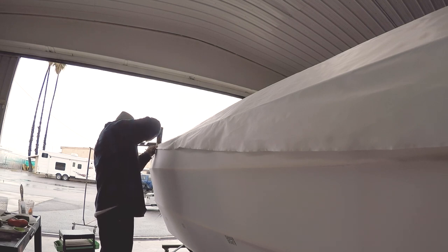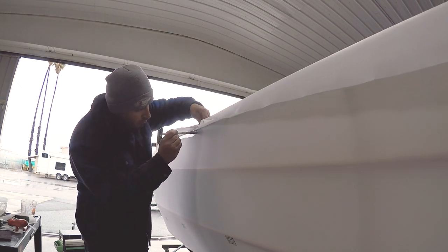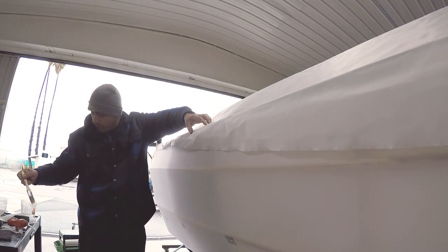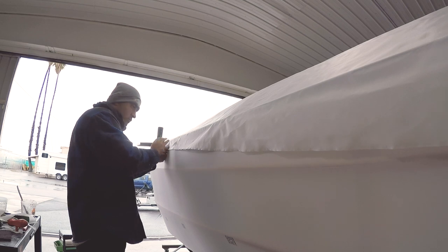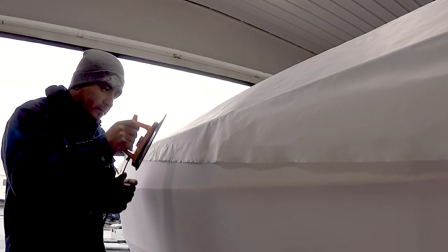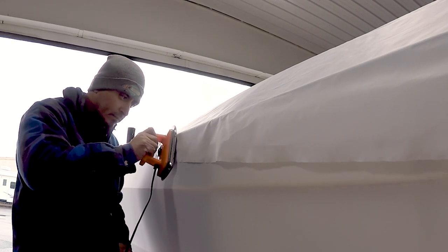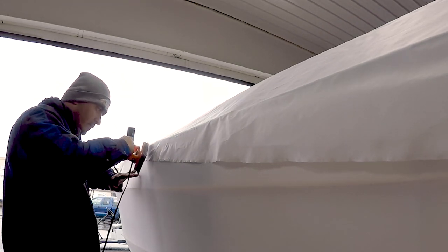The rule there is one inch of overlap. I just take a one-inch brush, brush into the belly, and then take a squeegee — or my hand — to glue the fabric into that belly. Minimum of one inch; you can go more, but the minimum is one inch. Try to keep it wrinkle-free. If you have wrinkles, take the iron and heat-form them out in that glue area — you want that super smooth so you can draw your line and trim it later.